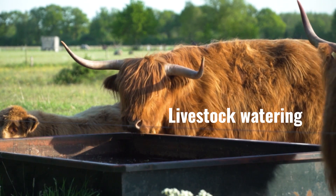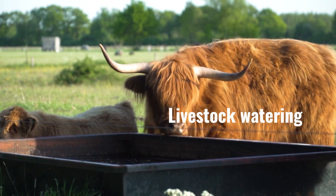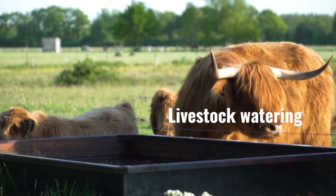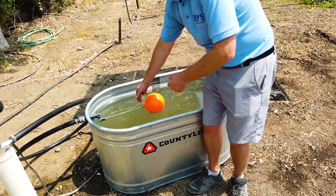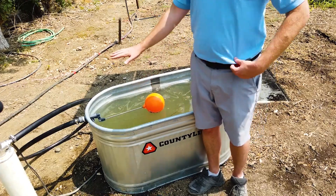The third most common application is livestock watering. You take a central tank, fill it up with a solar pump, and then put your TPP system there. From there, it's like a classic water system — run pipes out to your various tanks or livestock troughs and use classic float valves to keep them full. The TPP will kick on anytime the livestock drink from those tanks, draw them down, and then start to fill them back up.